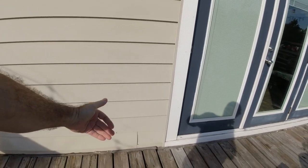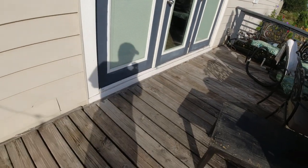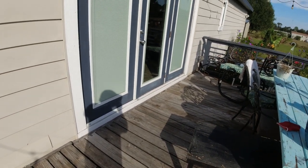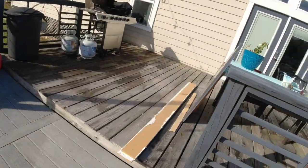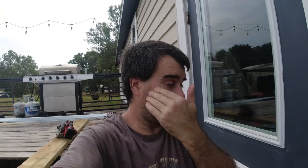Inside, all the beams that run against that one piece of rotted wood — I have to reinforce those because the edges are just gone and there's nothing to screw the board onto. I need to cut some two-by-eights and scab them onto the good part of the existing board. Once we get this all torn apart I'll come back and show you. We have a bunch of people coming over to help move all this stuff.